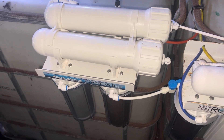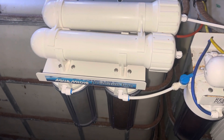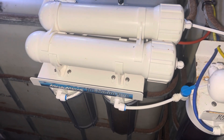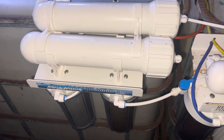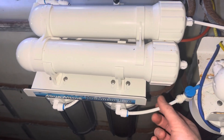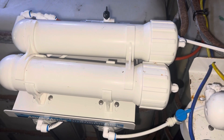This is called an RO unit. What an RO unit does is pass the water from the tap through an RO membrane and a bunch of other filters in order to give very pure water. The water comes in from the tap, then there'll be one which is a drain, and then there'll be one which is the RO water.